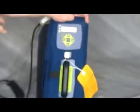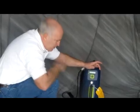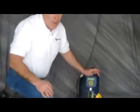You'll notice the pump stopped running because right now it's going to run through another purge test to zero out the filter, or zero out the bench, and now I'm back to zero PPM.